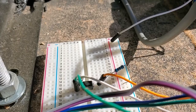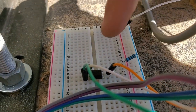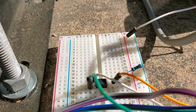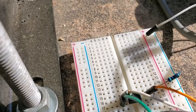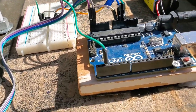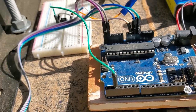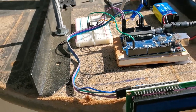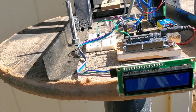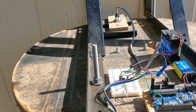This allows current to light the internal LED of the optocoupler. When the light of the LED hits the base of the phototransistor inside the PC817, current goes from the collector to the emitter, causing pin number two to be grounded and go low. Since I'm using an internal pull-up resistor on pin number two, no resistor is needed in the circuit. And then all of this is displayed on the LCD.